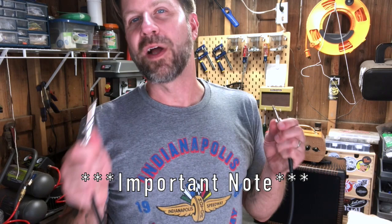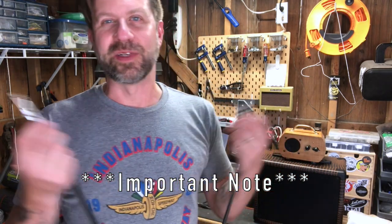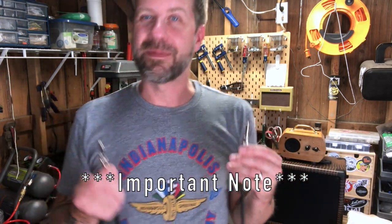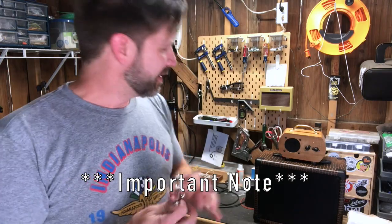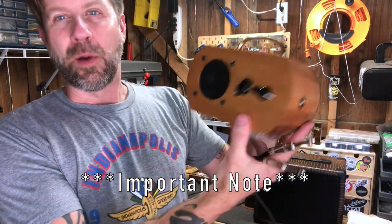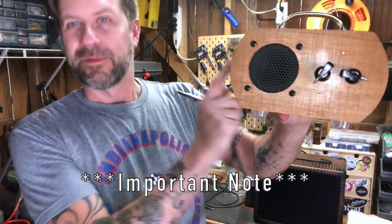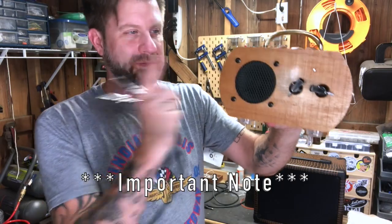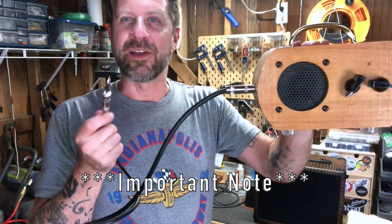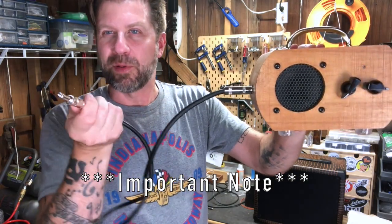Now, one thing that I want to note that nobody really talks about when they talk about doing this mod, there's a few other videos out there where people talk about doing similar mods, but what nobody talks about is, if you think about it, on an amp the output power is being produced, it's going through the speaker and back to the output transformer, and it's always doing a loop, right? So as soon as you plug this cable in, I've now broken that loop. It's going to this jack, but there's nothing to complete it because it's not plugged in yet.